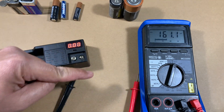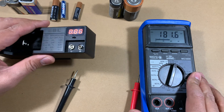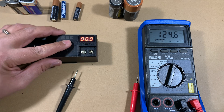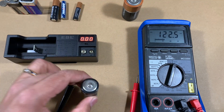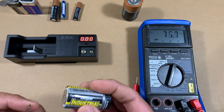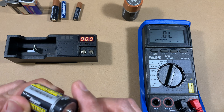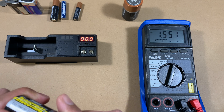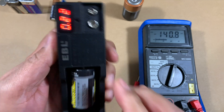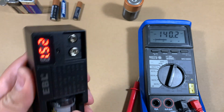You'll notice it's not identical, but this is a much more sophisticated multimeter and this is a $10 unit, so it's doing a pretty good job of giving us a fairly reliable result in terms of whether the battery is a keeper or not — which is ultimately what you're trying to test. This next battery is a type-C, also a 1.5-volt battery, not a very common size but I wanted to show the tester can handle it. This one reads at 1.55 — a pretty full battery — and comparing against the tester it shows 1.51–1.52. Again really close.